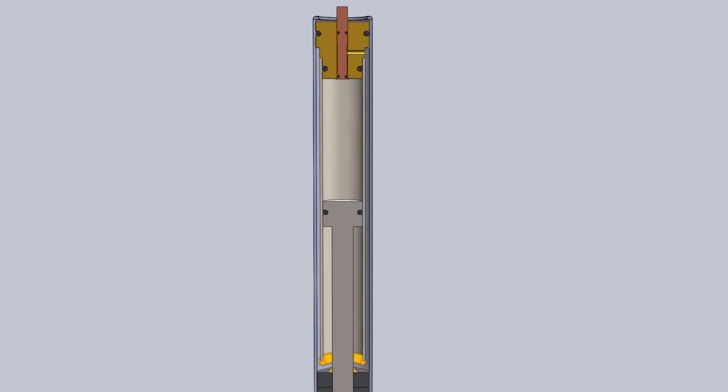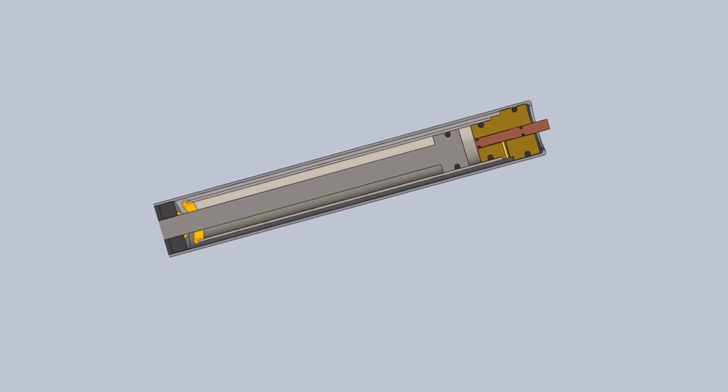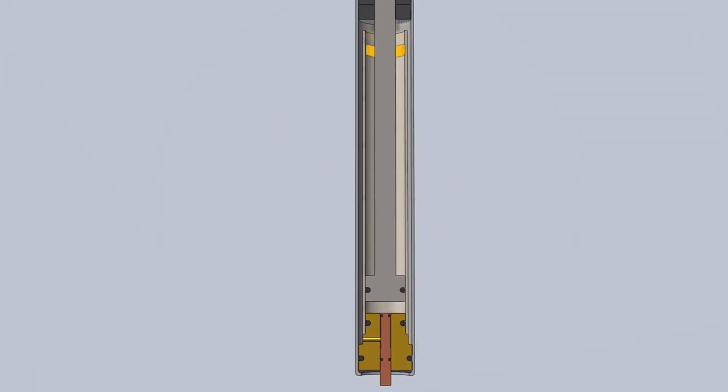Lift cylinders have a little lubrication inside the cylinder. If the cylinder still has pressure, the lubricant is probably still there. However, over time, the lubricant may settle to the bottom of the cylinder. It also may have been wiped off the inner cylinder, causing a slight leak between the piston and the inner cylinder. Over the past year, I found that flipping the cylinder upside down often restores the operability of the cylinder. I theorize that this is because the lubricant that settled to the bottom of the cylinder is redistributed when the cylinder is inverted. So I have a 3-step progressive process to try to restore functionality to the lift cylinder.